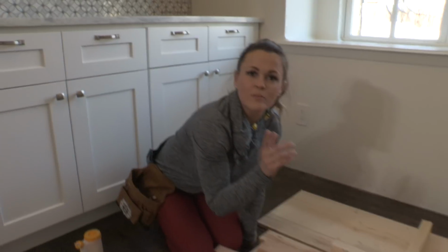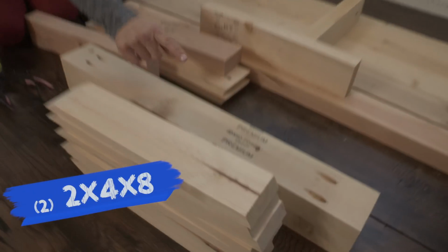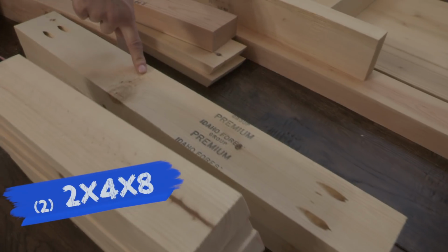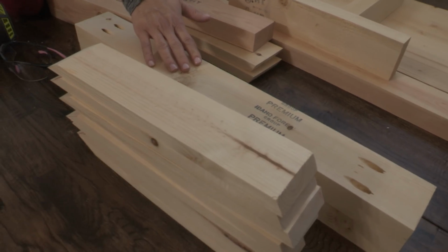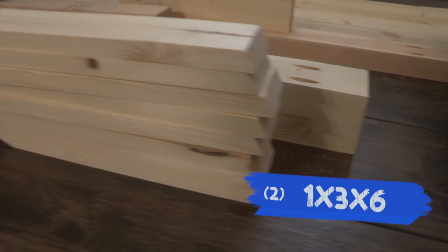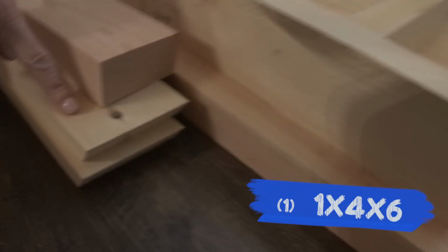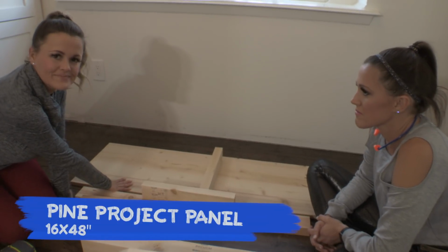This is all you need to build this 6-board farmhouse desk. 2 2x4x8s. We have ripped these down to 3 inches. You can check out our video below in the description box to see our video on how we rip those down. You also need 2 1x3x6 boards. And you need 1 1x4x6 board, that's right here. And then you also need 1 16-inch by 48-inch pine project panel.